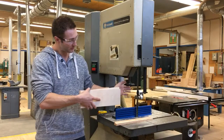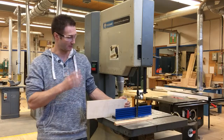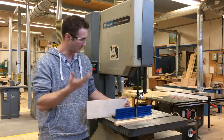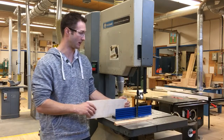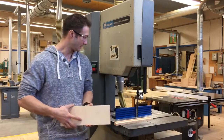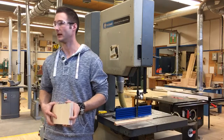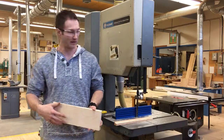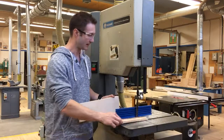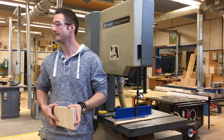Just a real quick tip: when re-sawing, don't push hard — let the saw blade do the work. Just a nice, even, steady feed. There's no need to try to ram this thing. If you have to push too hard, the blade's too dull. All the other rules of the bandsaw apply — stop partway, no worries about kickback, let the board sit there while you grab a push stick and switch over to that as you finish off the cut. All right, any questions? That's it.